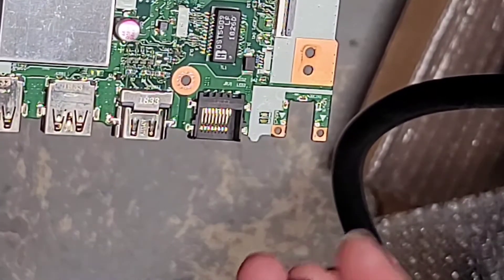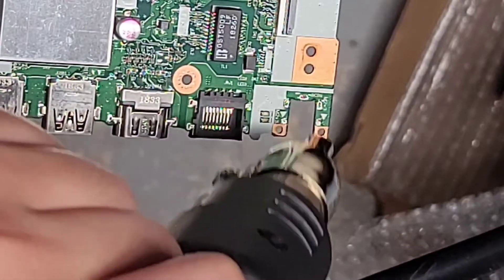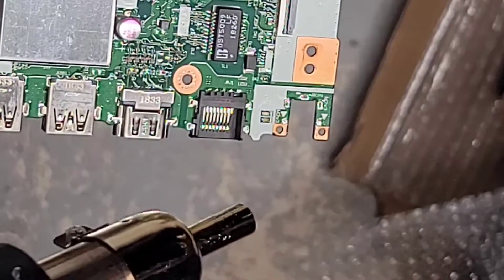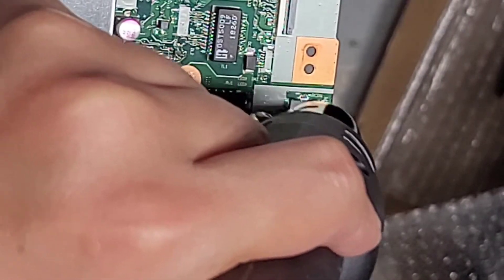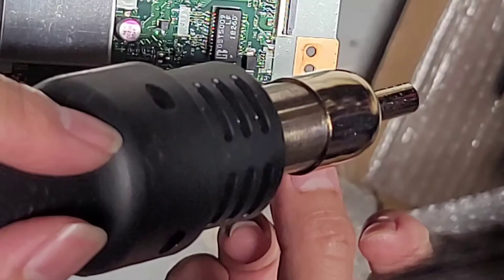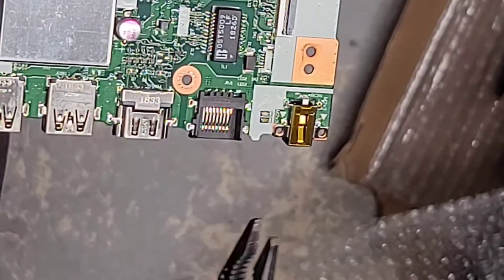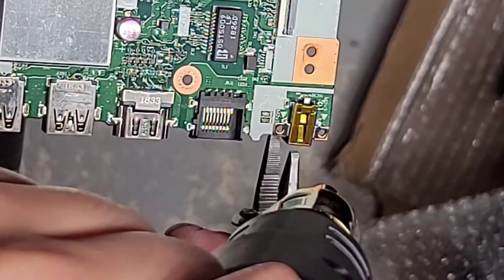Then you take the replacement one. Usually the solder will kind of melt and be in the way, so it's going to be a pain — you have to heat this up. Usually I won't do it this way because it's not as good. What I'll do is use the air turned up kind of high and try to blow the solder out. Now it's really warm. You can put the part there, try to heat it up, and use the pliers to push it back down. You don't want to touch this with your bare hands of course.